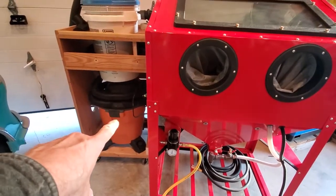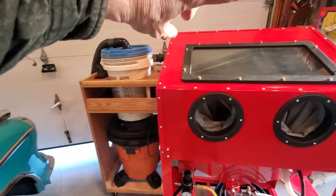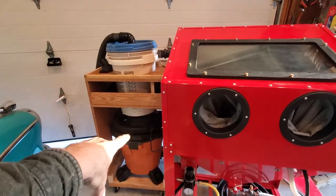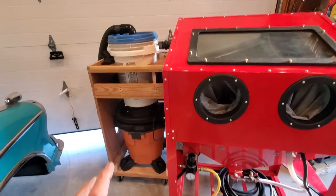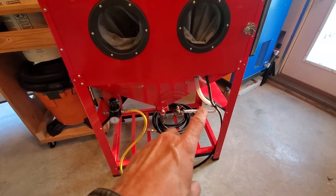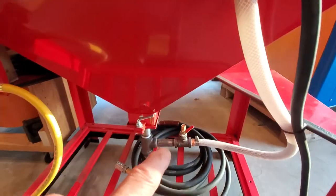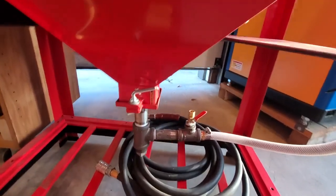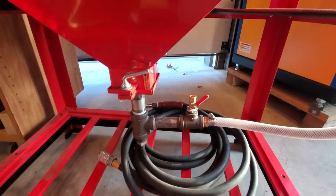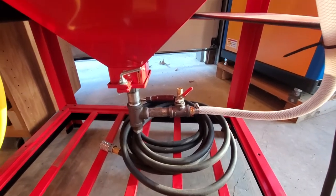From Home Depot: a Ridgid shop vac. Chlorine pool bucket, existing wet-dry vac elbow — one eight-foot hose cut for the chlorine bucket down to the shop vac, which is removable from the frame for standalone use since the casters are attached to it. For the metering valve: a quarter NPT ball valve from Harbor Freight and Lowe's for the other parts — a one-inch T, three-quarter-inch T reducing down to the quarter NPT.